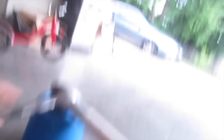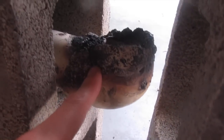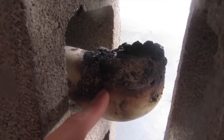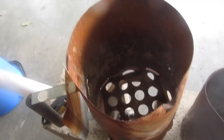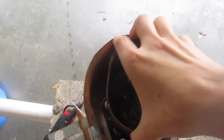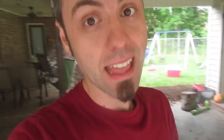To do that, we take a hairdryer, connect it to a PVC pipe, and put an elbow on the end. As you can see, this one's getting a little charred after 30-some-odd burns. That pushes air up through the charcoal. You're going to put charcoal on the bottom, put your crucible on there, then put charcoal all around your crucible, and then light it up. That gets it hot enough to melt aluminum.